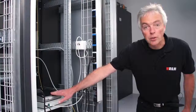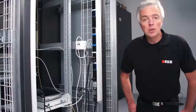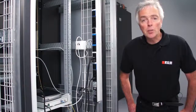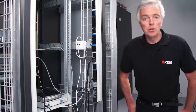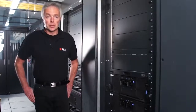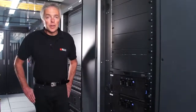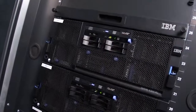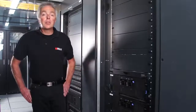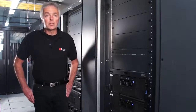This is the concentrator. The concentrator has an Ethernet connection to all analyzers, aggregating the information from all analyzers and all sensor bars into a single uplink, which is then sent to the IntelliFi managed server. The server contains the central database which holds the entire network configuration. It is connected to the concentrator and gets live updates of any changes in the network. The server can either be customer installed, or it can be set up in the public cloud, providing IntelliFi managed as a software as a service.